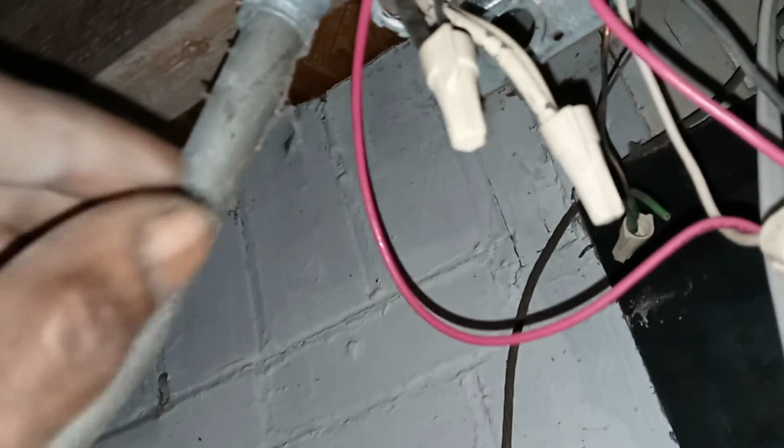Oh man. But this update was to show my customer what's going on, how everything is going. And I think I'm going to get rid of this Monday, for the simple fact that eventually that wire is going to start wearing, and you already know if it starts wearing, it's going to arc, and it's problem after problem. It's time to get rid of them, because I can put plugs in. I can put a couple plugs on each floor just to keep certain power. So we need at least 6 more, so we need 1 more box. All that wood that I use for bracing will get reused throughout the house. And clean this up again.